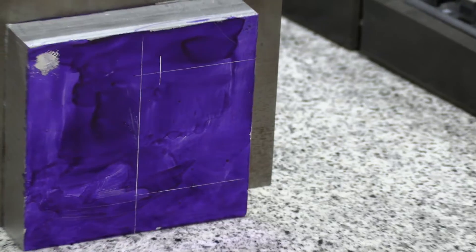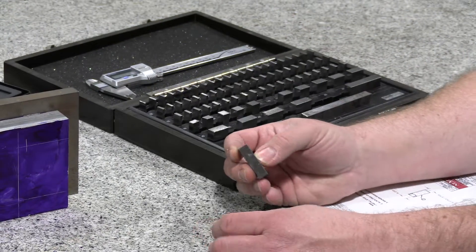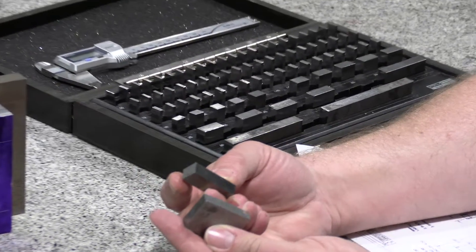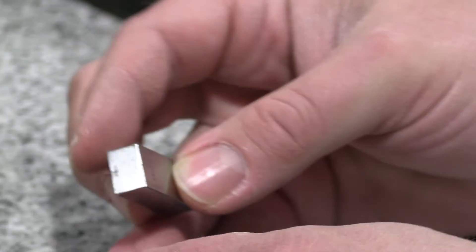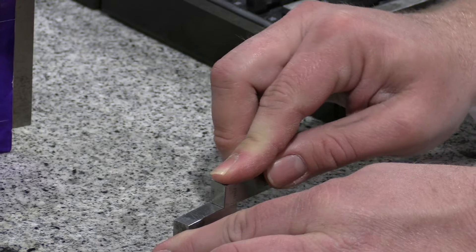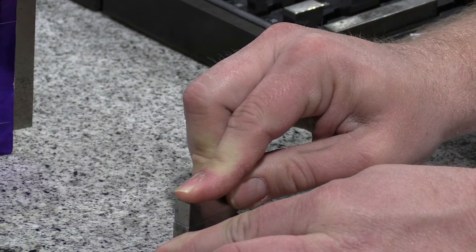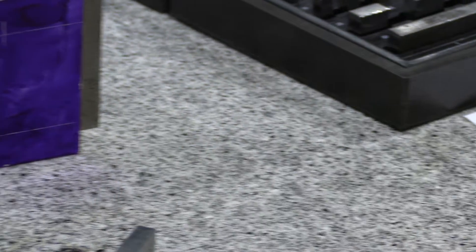Your next line is inch and a half. With the inch and a half, you have two blocks you need to use. This is where we're going to wring our gauge blocks together. This is an economy grade set just for training, but they still wring. Because these are ground so flat, if you put a little pressure and slide them together, it displaces all the air between them and you get a really accurate stack — as best you can for the grade of your gauge block.